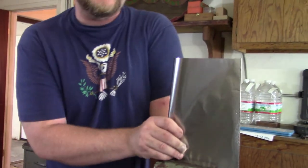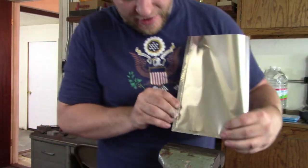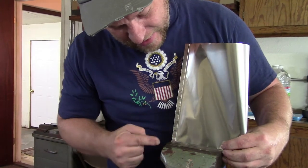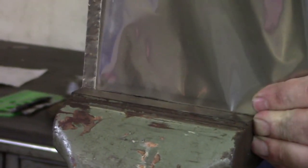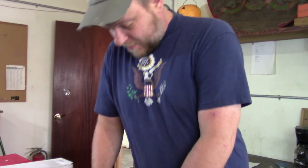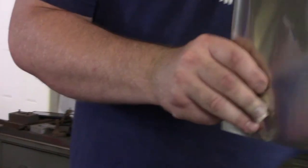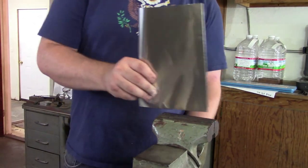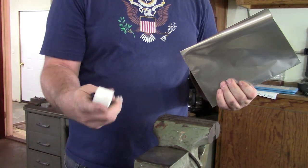We like to keep it as clean as possible because it'll fit in the furnace better. Without all the weird corners, you know you're getting a good airtight seal. I turn it this direction now, line up that folded edge with the vise, close the vise, and that gives me a perfect spot to fold it over — stainless steel origami. You can see the fold gets thicker and thicker while the vise doesn't care; it just crimps it closed. That's why I prefer the vise over the plastic roller.